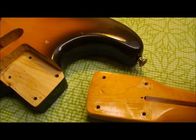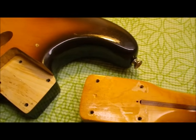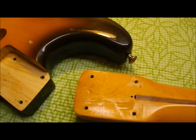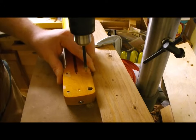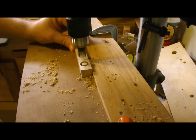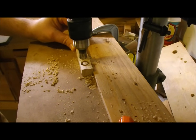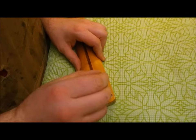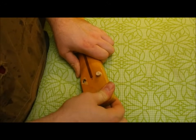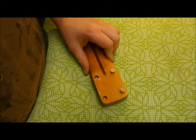How are we going to plug them? We're going to use maple, because that's what the neck is made out of — and it's going to be flat-sawn maple, because that's how the grain is oriented. Using the same material for plugs means the neck is less likely to develop strange bumps at the end of the fingerboard. This cutter makes a 3/8 inch plug which is very gently tapered — they will expand slightly and snug up really tightly in their holes. I just drilled to the bottom of the original drill line, which was about half an inch or so, and I'll let these dry overnight.